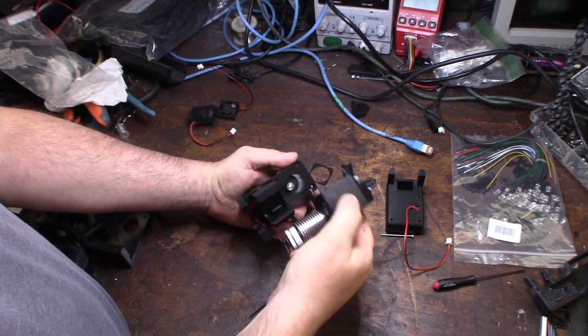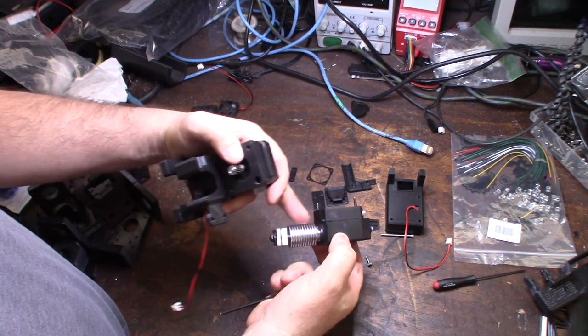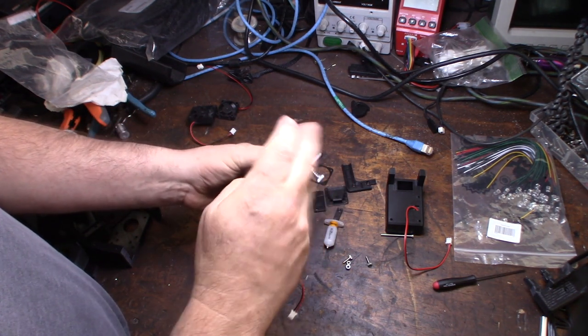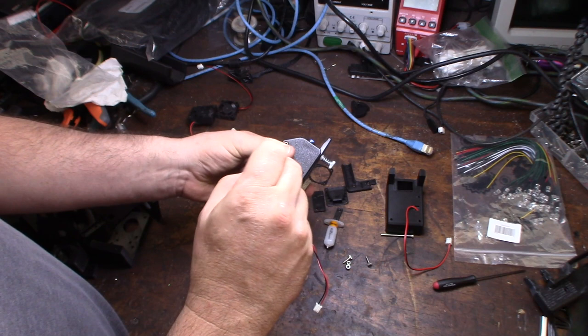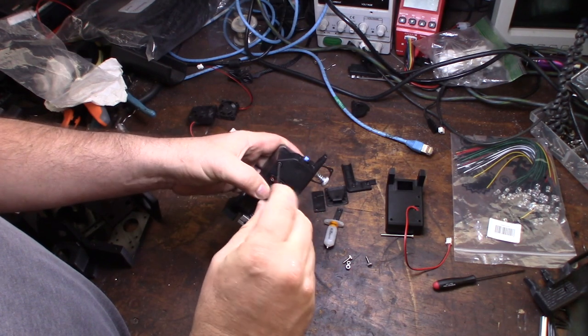I wanted to be able to get this thing off in just three screws. If it gets clogged, three screws and it's off. With other designs I have to take off all the fan ducts just to separate the hot end from the extruder. My favorite extruder is the Bondtech BMG-style — this is a clone, but it's been great.